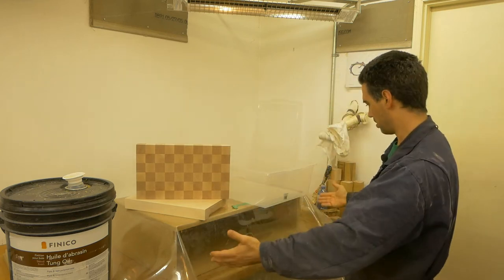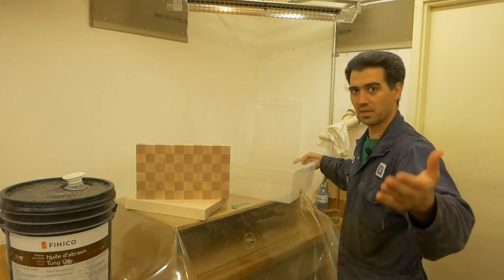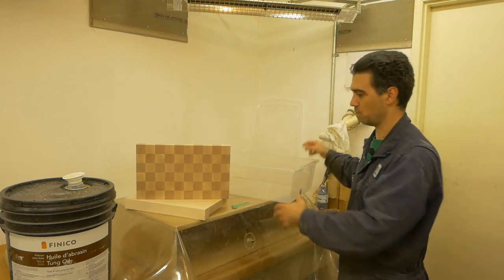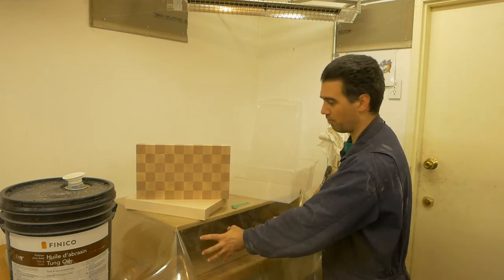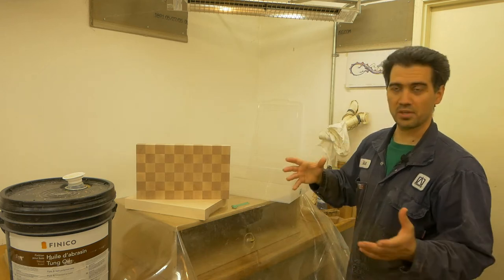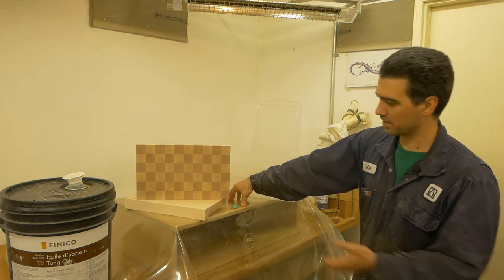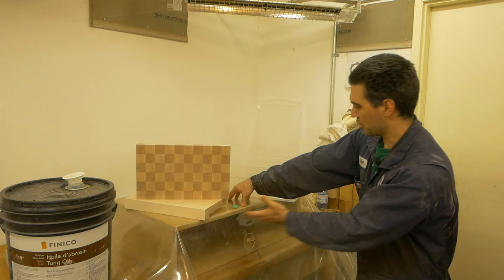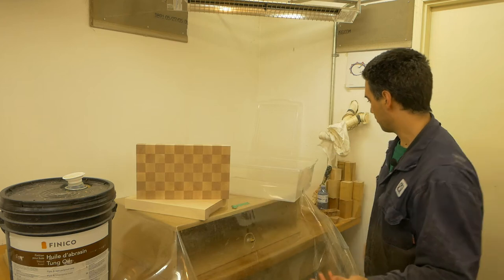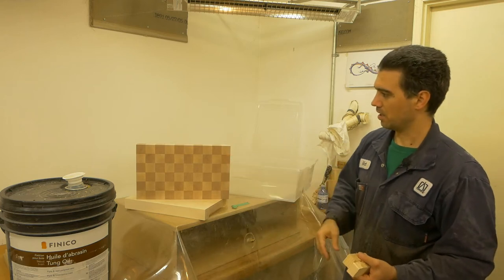So I've built a little box that is going to serve as protection. It has a few holes on top — I need to zoom in so you can see — but those holes mean that once the vacuum is created, it's going to withdraw the air from the box itself, thereby creating the vacuum I need. However, with all that 14 pounds per square inch acting upon the large unsupported area of the box, there is the potential of collapsing the box itself. I believe I have found a solution that will also solve the buoyancy problem.